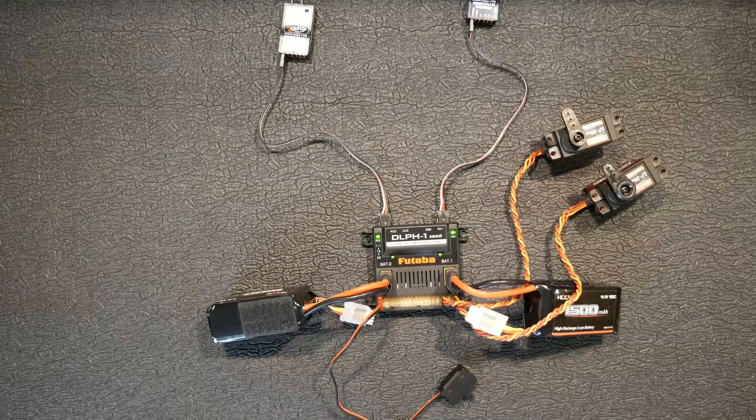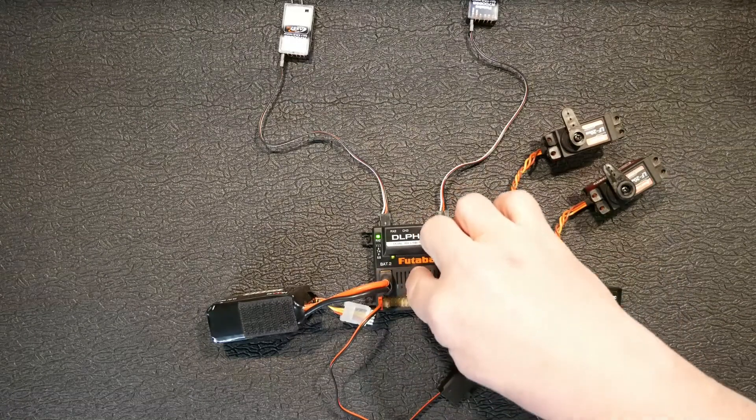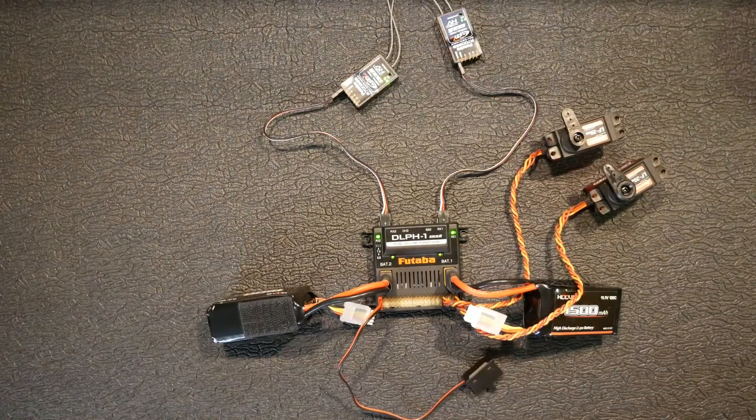There are some systems that are more similar — right off the top of my head, FrSky has the RB series in their Flight Safe system, which is similar to this setup. Those have two battery connections with smart switching that goes back and forth between the two batteries. They also have multiple receiver hookup inputs through their S-Bus or S-Port system. I believe their RB40 can actually run three receivers off of it.